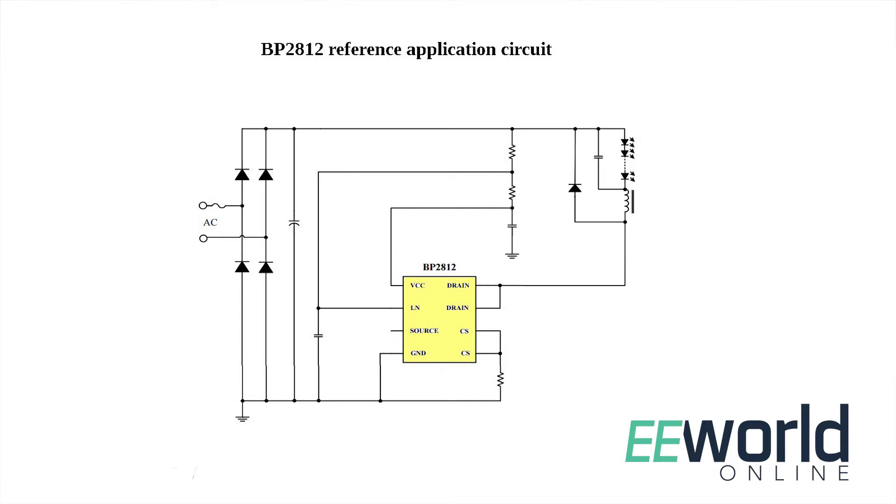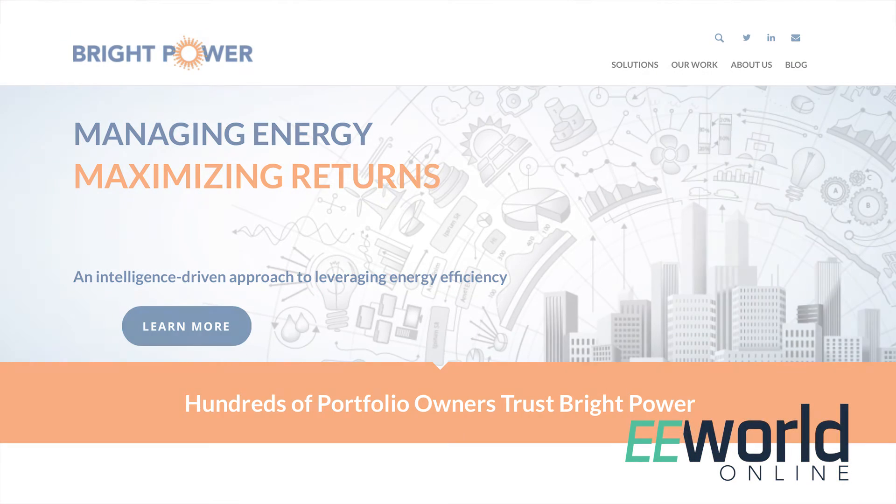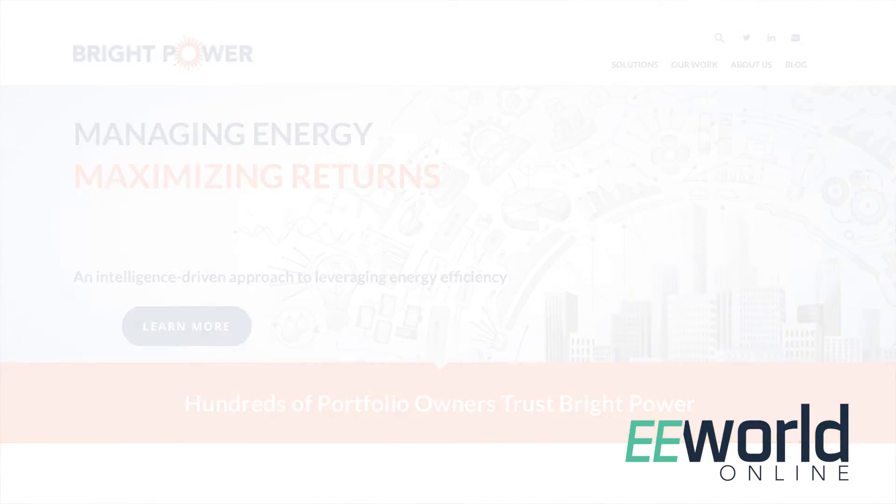Like most suppliers of driver chips for LEDs, Bright Power publishes a reference application circuit for its device, and this typical application circuit listed on the BP2812 spec sheet comes extremely close to the actual circuit we found on the LED circuit board. Seven resistors go into simple networks that handle the V sub CC voltage, sensing the buck inductor's peak current and regulating the input voltage to the IC. Five capacitors handle AC line filtering, AC bypass for the V sub CC pin and line sense pins, and the buck topology. An inline fuse cuts power to the whole circuit in the event of too high a current draw. We also found something interesting on the website of Bright Power — it looks as though Bright Power may have assembled the circuit board itself, as images on its website show example circuit boards for other LED applications that look remarkably similar to what we see in this bulb.